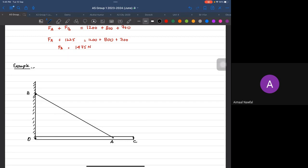Now they've shown some forces. One force is acting from here, which is 30 newtons. The other force is acting here, which is tension T. And there's also one force acting this way, which is reaction R. So this is quite different. Then they have given you this distance, which is 10 meters. This distance from here to here is 6 meters. And from A and C, they've also given this distance. This is 3, and that is 3. Ignore my drawing, it should be less on that side anyway. So this is given, right?